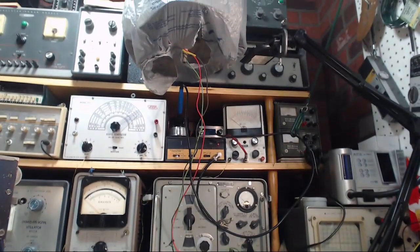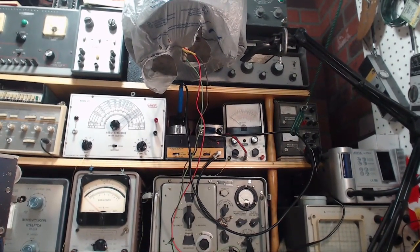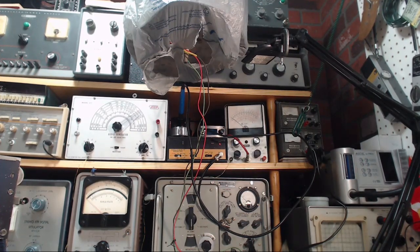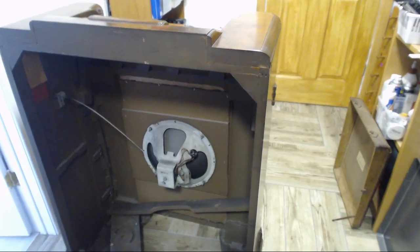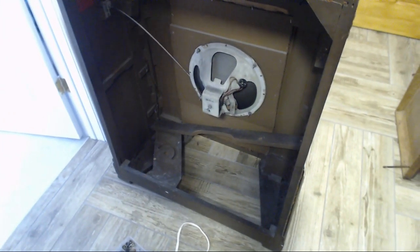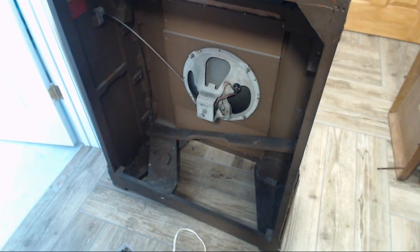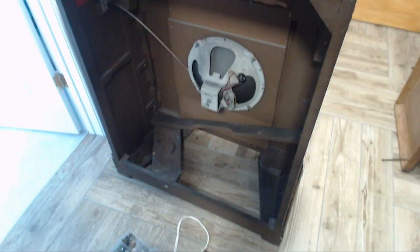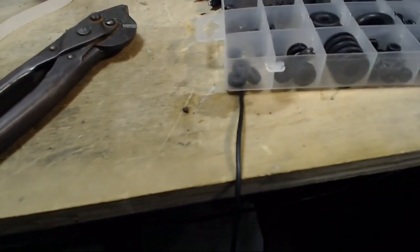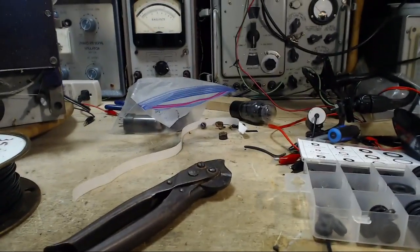By the way, when I was talking about speakers and how you baffle the air from the back of the speaker so it can't get around to the front, when you look at the radio here, and like all these radios, there's no back. This is not a sealed box in any way. Look, it's open to the floor even. That's just giving enough distance that the air leakage from back to front just isn't effective. It's just a big enough box, that's all. Suppose if you seal the back up, it would change the tone and might not improve it at all.